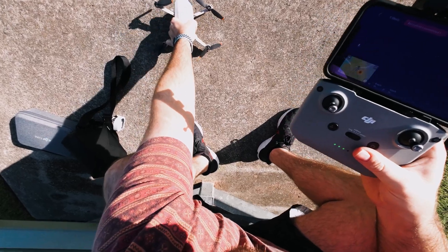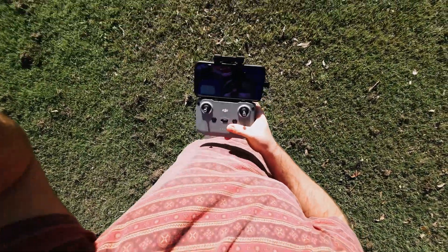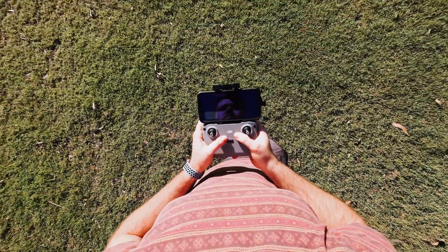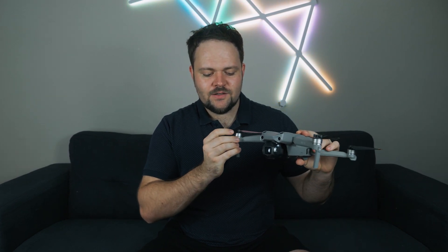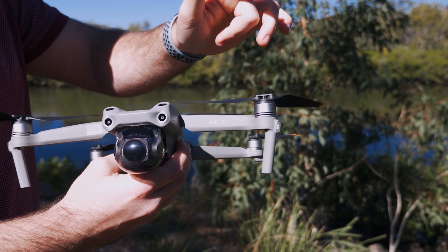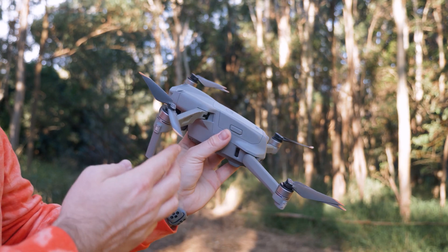A lot of drone pilots don't do this check because they don't know about it. If they actually went through a course or some sort of certificate they would know these kind of things, but a lot of people buy a drone and don't have any of this knowledge. That brushless motor should have no contact at all — it should just glide. The reason this check is really important is because what could have happened is you might have had some grit, dirt, or debris from anything you accidentally knocked into, or maybe there's some sand that's been thrown up in the air and got caught up in the actual motors.